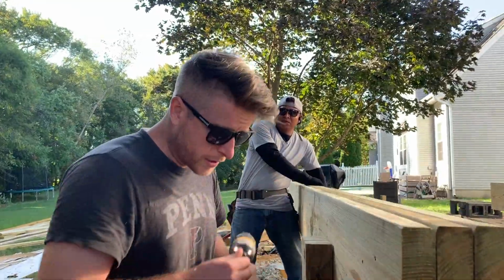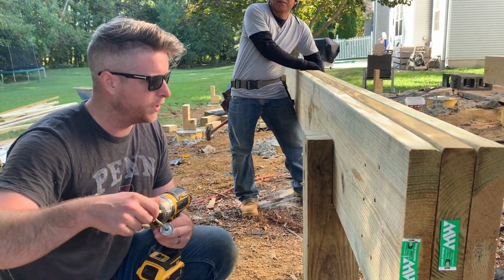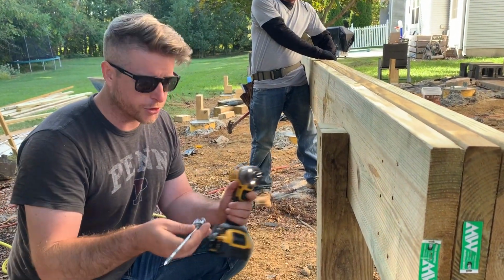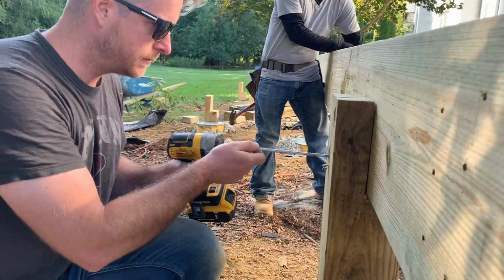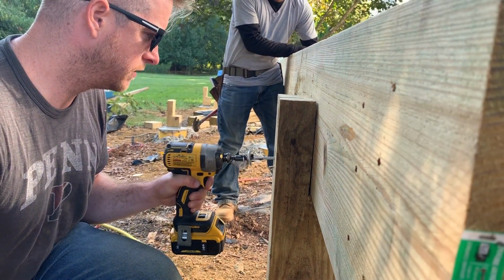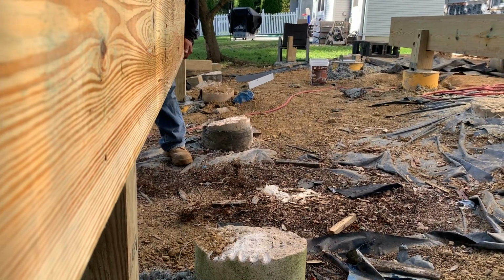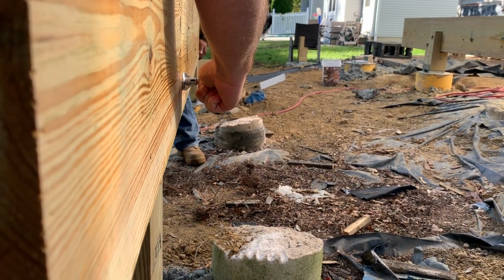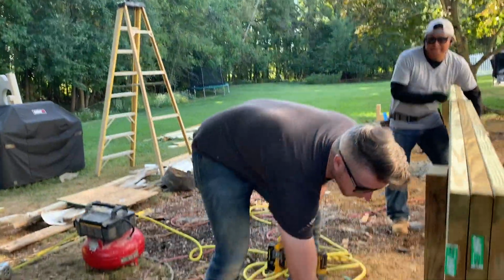Whoa, hey buddy. Normally, when you're setting beams like this, you'd use carriage bolts to go all the way through this notched post, but we have these Fasten Master through locks, no pre-drilling. You just set it in there like this. Wait for it to poke out. There she is. Put this cap on. Nice and tight, super easy. That took what, like 5 seconds?